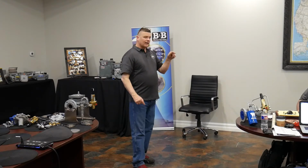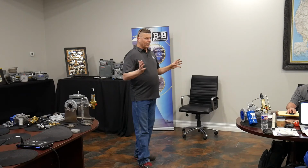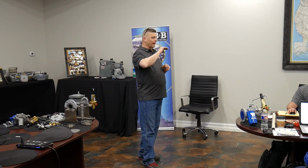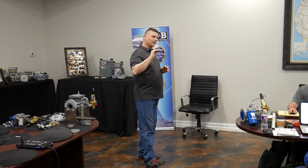Okay, so let's go into that CG number really fast, and we're going to do some sizing here in a minute. So what exactly does that give me? You have it in a general sense that it's identifying capacity, but there's a simplified gas sizing equation, and it's in the Flow Grid brochure that's part of the stuff that I gave everybody. The simplified gas sizing equation basically says that if you want to solve for the CG, you just take the maximum flow rate, Qmax, which is in 1,000 cubic feet per hour.